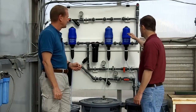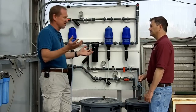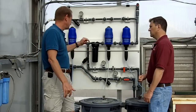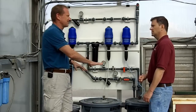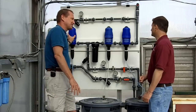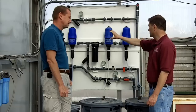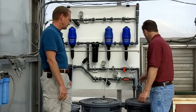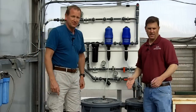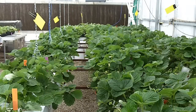After the injectors, there's also another line here — sometimes, say early in the crop or at other times, we don't even need acid. So we can bypass the acid altogether and deliver just the nutrient stock to the crop. One advantage of that is we eliminate the pressure reduction that comes off this additional injector. So you can bring it through, add your different stocks at the concentrations you want, adjust pH or bypass the pH adjustment, and basically have two lines heading out to the crop. That's actually what our next video is going to focus on — following the fertilizer solution once it's prepared, out to the crop and to the plants.